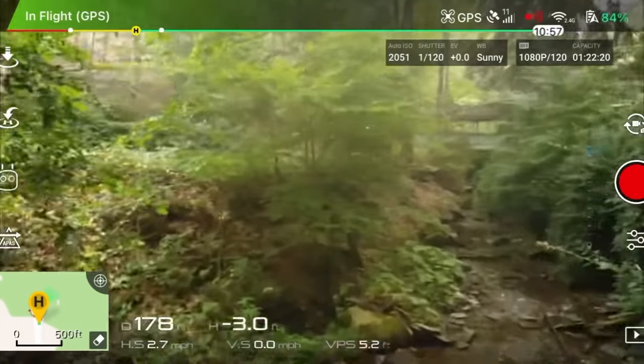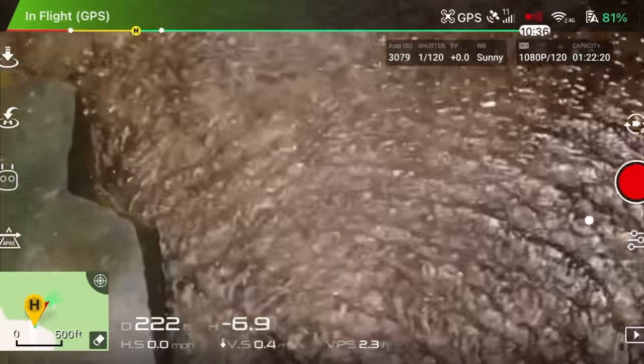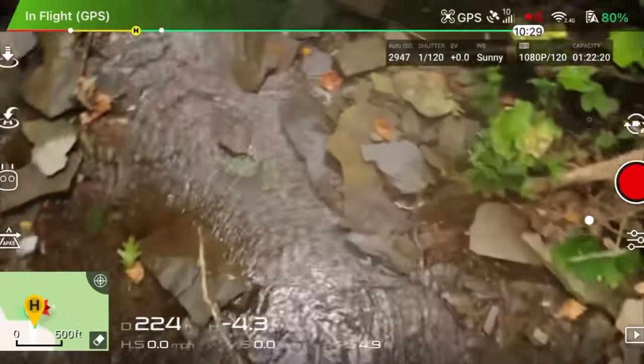As we make our way up the creek and drop elevation to get as close to the infeed pool as possible, we can see we are 7.5 feet below our takeoff point. That leads me to believe we could have an effective siphon — we actually have about 15 feet of elevation change from the creek bed bottom down to the pond. This is what I absolutely love about having a YouTube channel. I'm only 30 years old and I'm an accountant, so I don't have experience with ram pumps or moving water, whereas a lot of you watching have been doing this for 20 or 30 years and leave awesome suggestions in the comments. Now I know from checking our elevations that a siphon will indeed work and it's going to put out a lot more flow than the 1.33 gallons per minute we're getting with this hydraulic ram pump.